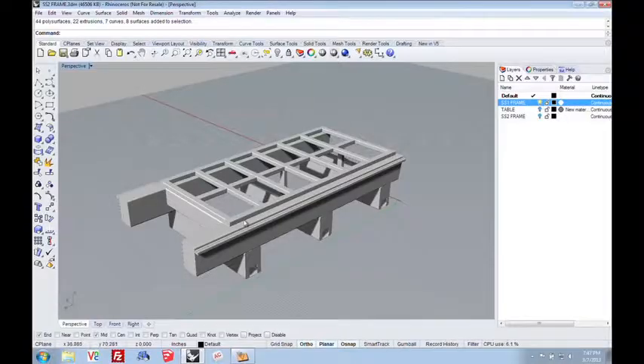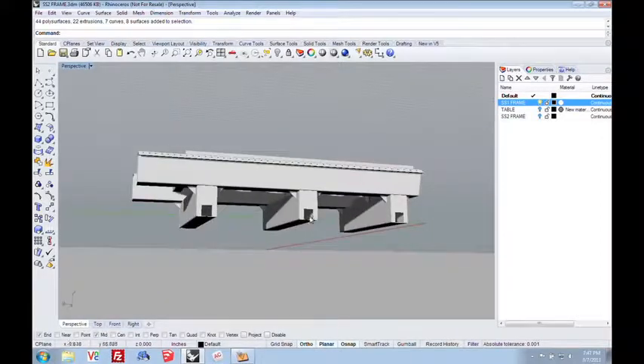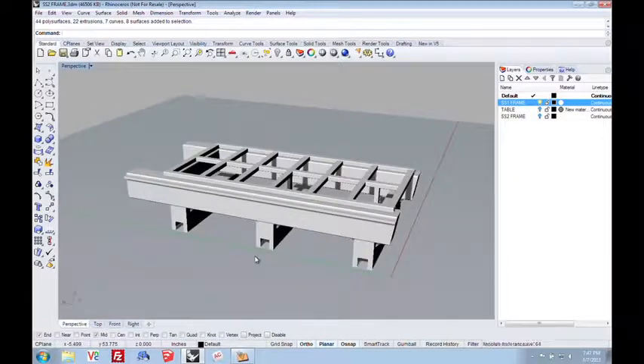What you see on the screen is one welded assembly — it's tubular steel, all tied together. That's what makes the machine work. In machine tool design, if you don't have that frame, it doesn't matter what you hang on the rest of it. Within this price range, it's real common to see machines that have bolt-together frames, lightweight aluminum, really flimsy construction. They try to stick a brand-name spindle on it and say it's a great CNC router, but if you don't do the fundamentals it doesn't work.